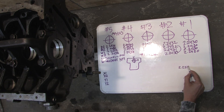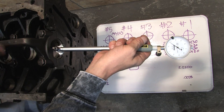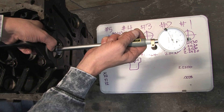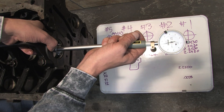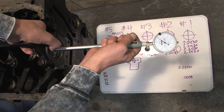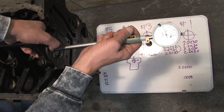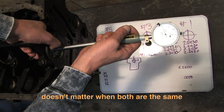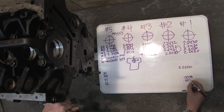We know we have our tool zeroed at 2.2500 — four decimal places. You just do the math, make your subtraction, and that's your final value. I've re-zeroed the tool after the bump and I measure again — looks like we've got our .0038 back. We move it into the next closest spot to get our second measurement — looks like we've got 38 again, and that's a good thing. So my Y2 value again is .0038.